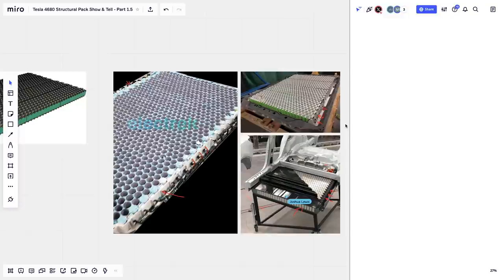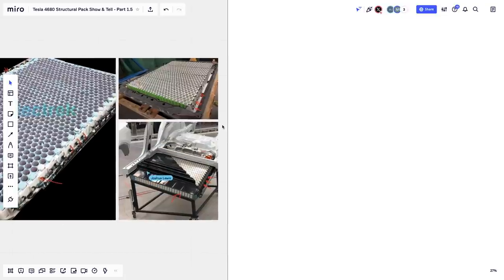The Giga Berlin cross-section image appears off-center because it's intercalated rows — you're seeing half of one row but the cells continue into the next row. Also, Tesla has shown us things before that turn out not to be exactly like that. For example, in the 4680 battery video, under the cathode nipple there's a white polymer disk as insulation. At Giga Berlin, the same cell shows a tiny black polymer piece plus some dark gray adhesive — very different from the battery day video. Tesla iterates rapidly and also may want to hide specific design details.